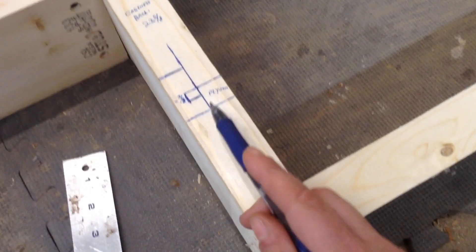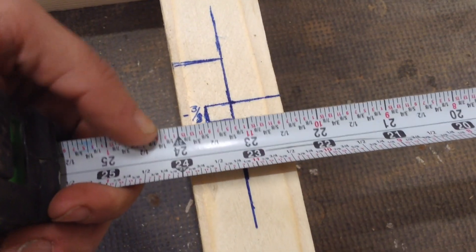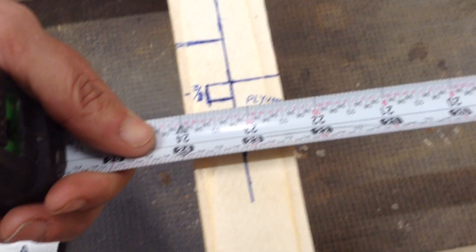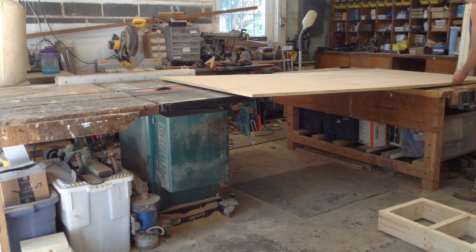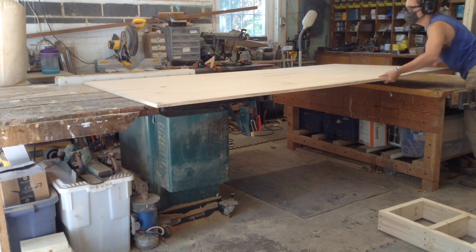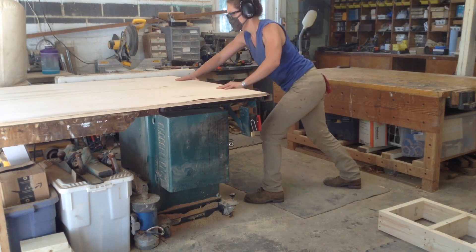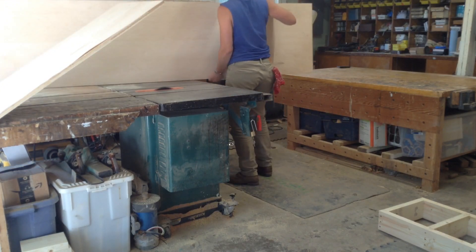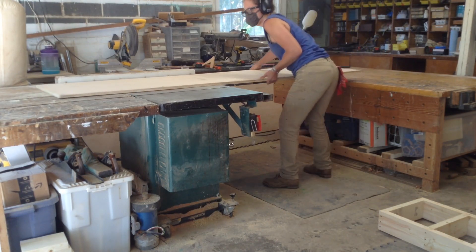For this video and to help people understand, I drew out on the base how I'm going to lay out my cabinets. I'm putting a face frame on all of these, so all of my depths have to be deducted from the thickness of the face frame. The newest way I like to attach face frames is by making a groove on the edge of my plywood carcasses and a receiving groove on the face frame. I have to subtract three-eighths of an inch from the depth of all of my pieces. Most of that math was already done because I had the plans drawn up. Essentially the back cabinet is going to be two large cabinets.